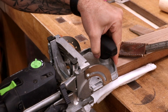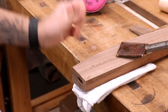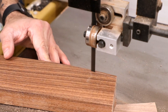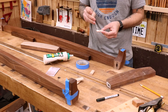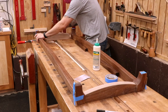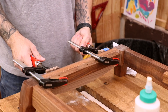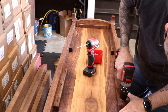Fortunately, the mortise in the rails is a breeze because we've got a flat and square surface to work with. With the rails and feet assembled again, I'll repeat the process of laying out and cutting the bottom curve, and now I can glue the frame back together. You know it happened, I know it happened — but for anyone who hasn't seen this video, the fix is totally undetectable. After the glue dried, I applied finish where it was needed and then attached the base to the case.